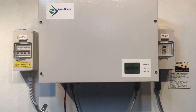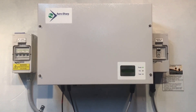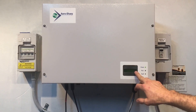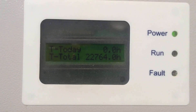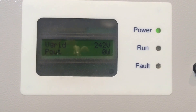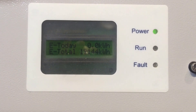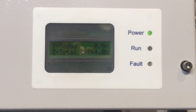At the moment it's still in the start-up procedure — you can see only the power light is lit, the run light is not yet lit, so it's still attempting to start up. It's telling us it's got voltage from the solar panels: 208 volts on input 1, and no voltage on input 2 because we don't have anything connected to it at the moment. You can see V grid — the voltage from the grid — and the P out, the power being output from the inverter, is still 0W. Hopefully very soon it'll try and start up and we'll hear some relays clicking inside the inverter.